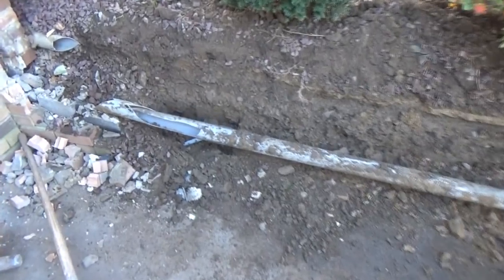If you're ever doing a job for someone and you're building a retaining wall, look over here. This is where that pipe went, and it wasn't even going up into the rain gutter right there. That's a big reason that this wall fell over — that's one of them anyway.